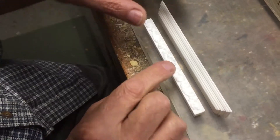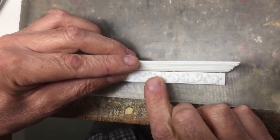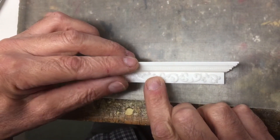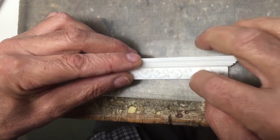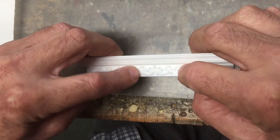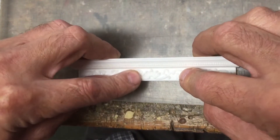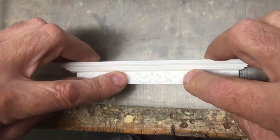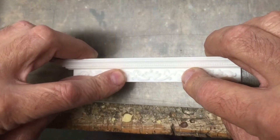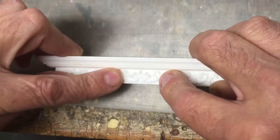We're laying this down and trying to line up those two pencil marks. You have a little time to do that — that looks real good. Now make sure everything is sitting flat on the workboard. Squeeze the pieces together and do what we call the 20-second stare: just hold these pieces together for about 20 seconds.